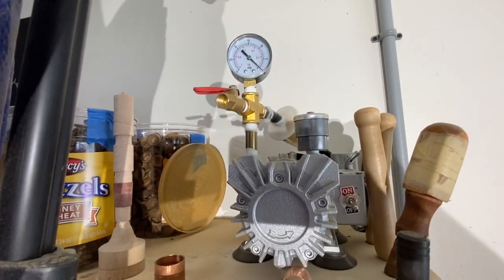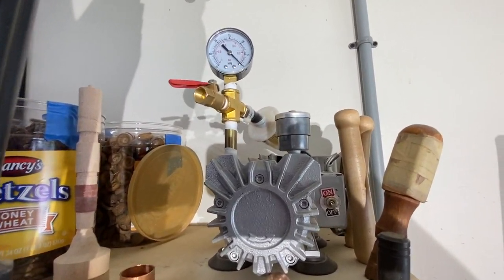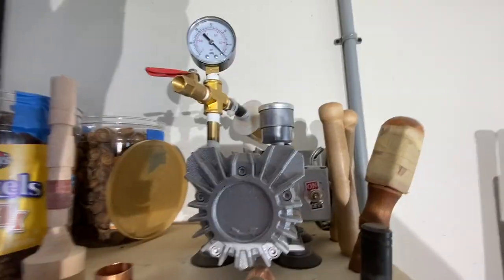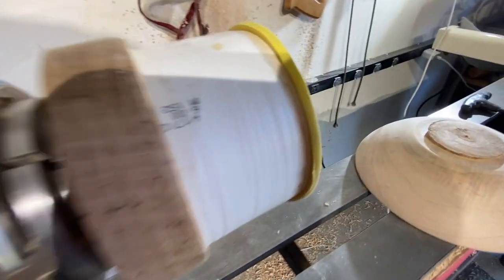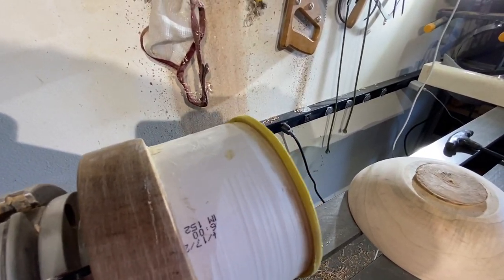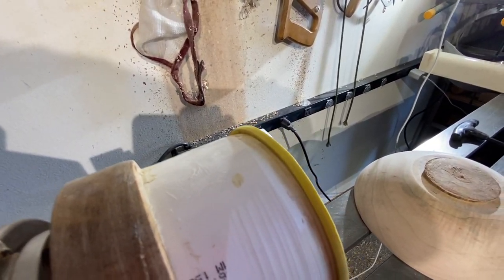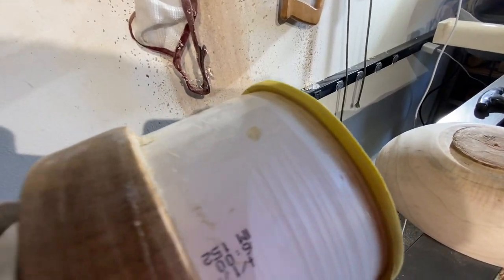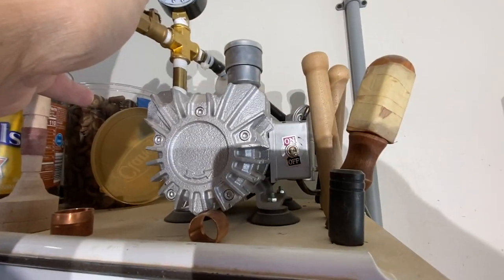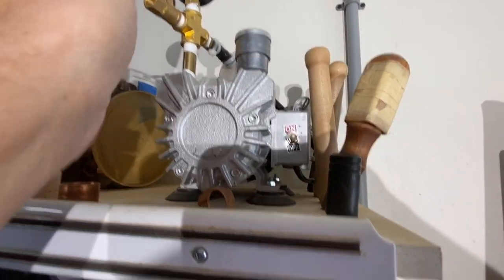As you follow up, that's where my pump is located. The advantage to having it where it is: you want it close enough to your lathe so you can reach the pump with your left hand and reach down to your tool with your right hand. You can move your bowl in and out when adjusting, and when you're done you need to be able to hold on to the bowl when you turn the switch off. You want it close by.